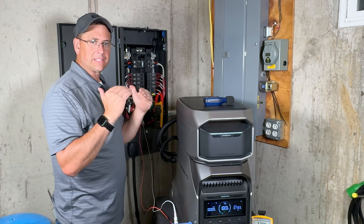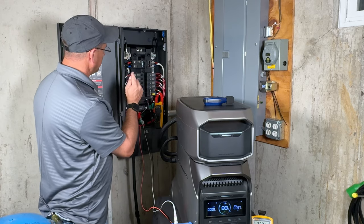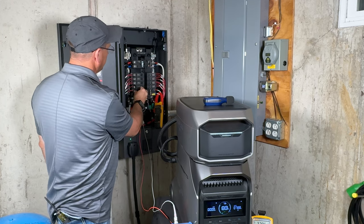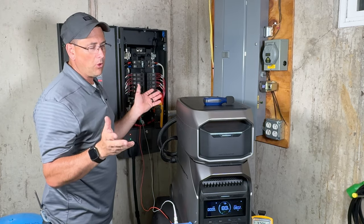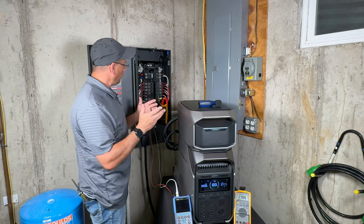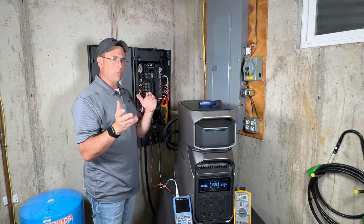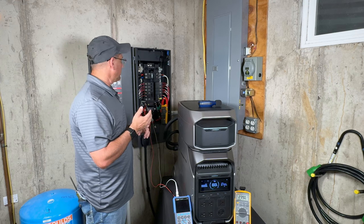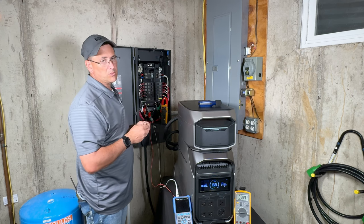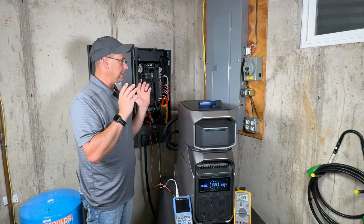The panel operates in four quadrants, each with a total of 60 amps per section — you can't just add them all together, which is why EcoFlow recommends having an electrician do the installation. You may also need permits. Check the EcoFlow website for special deals for California and Texas residents. Installation isn't too complex — some conduit, pulling wire, and running heavy gauge wire from your main breaker to the feed breaker. That's a brief overview of how the panel works.